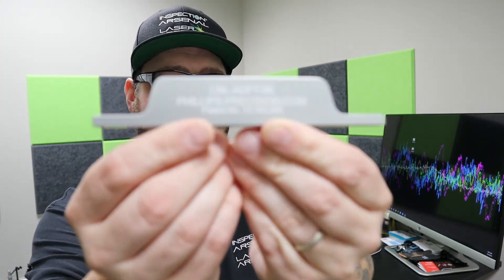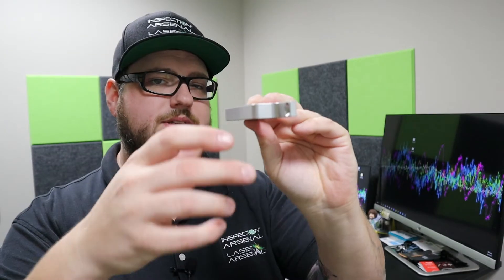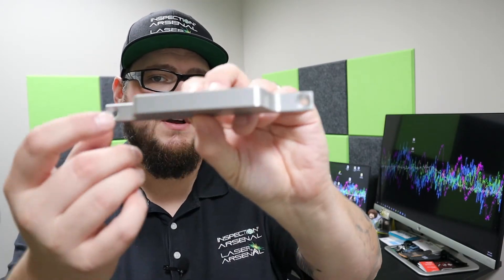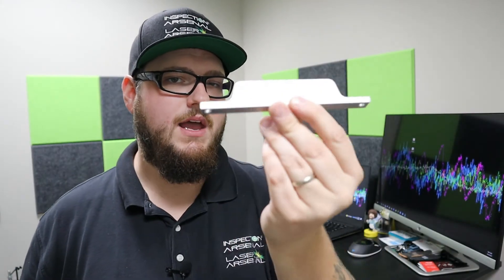In educating the world about modular quick-swap fixturing, many times I run into a dedicated fixture that you just don't want to get rid of — I understand it costs a lot of money. This is the adapter plate. It's literally just the male tongue of our lock-and-load plates. You drill a couple of 10-32nd holes in the side of your 10-by-10 or 8-by-8 fixture plate, put in a couple of flat-head screws, mount this to the side, and it now becomes a lock-and-load plate. You don't have to throw your old stuff away — we try to keep your shop as lean as possible.